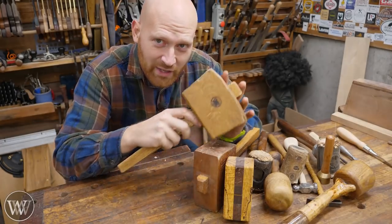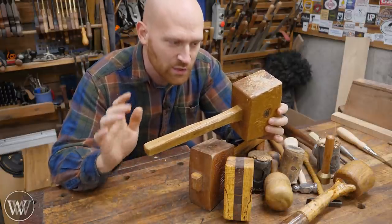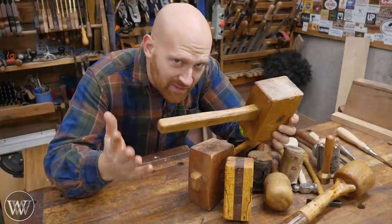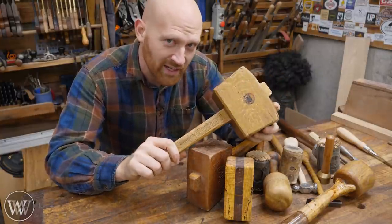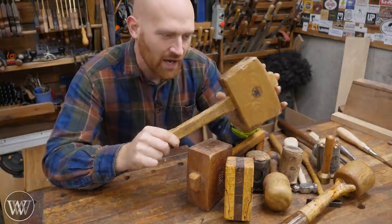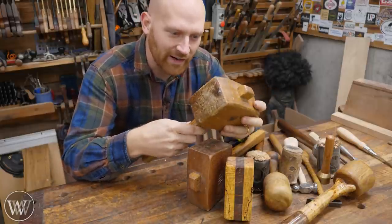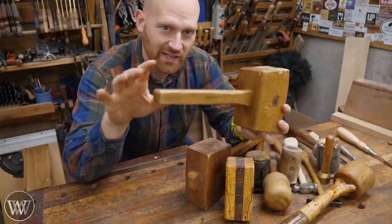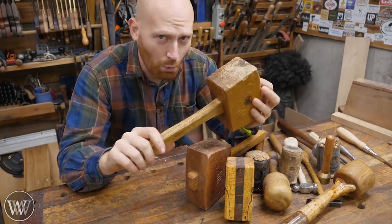The first one I ever made, and the one I usually suggest most people get, is a traditional joiner's mallet. Now this is one I really suggest you make yourself, because once you understand how to make it, you can change the design for so many different applications. You can make a mallet that fits you and what you want it to be. This is the mallet I probably use more than any other. When I want to persuade something to move and I want to use a little bit of aggression, I grab a joiner's mallet. A joiner's mallet usually is around two to three, maybe four pounds in the head. It's often made out of a big block of firewood, a good chunky piece. Some people make it out of a crotch where the grain's going everywhere. It's got a sturdy handle and I've got quite a few videos on making these.